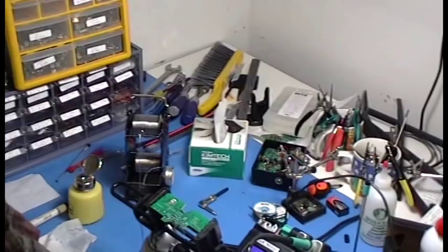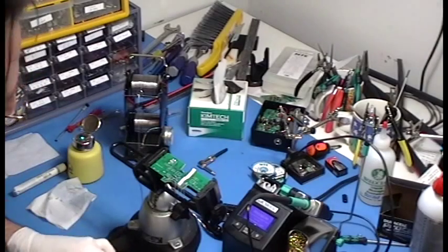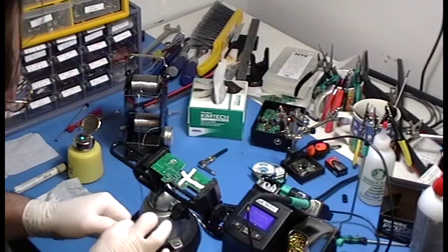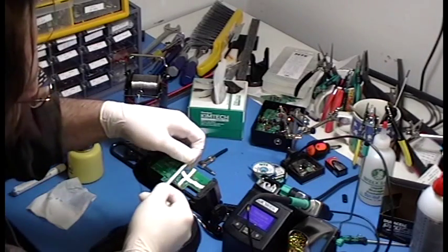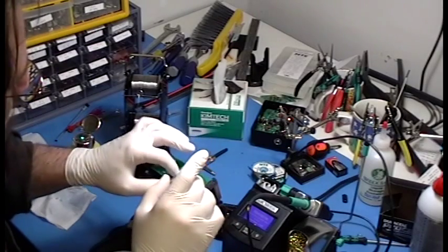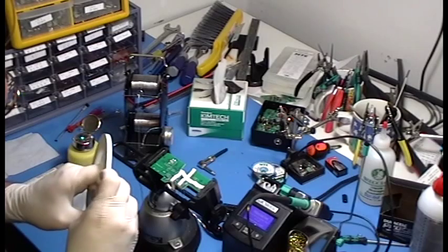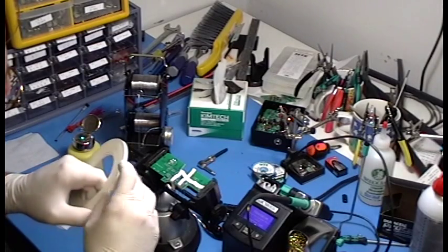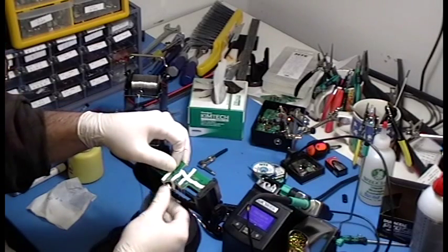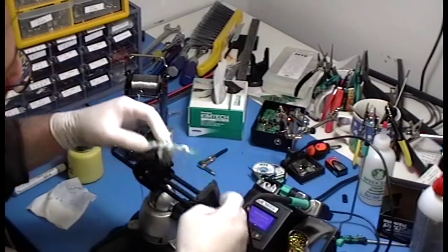So again, we're going to come in with my magic tape, which is great. We're not going to be able to do this with the caps. But wherever you can do it, this works great. No more bending of those stupid leads. Such an awful way to do it. If you could avoid it, there's good reasons to do that. There's some NASA specs and some mil specs too, and other specs that actually call for clinched leads, which isn't just bent over. A clinched lead, actually, the lead is right down to the board, and it's actually over the trace that it's connected to. It's a very specific method of doing it. I believe that's a basic NASA spec. That's a clinched lead. The bent lead, that's not a real clinched lead. Okay. Turn it over.